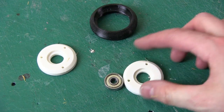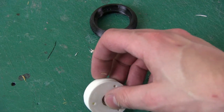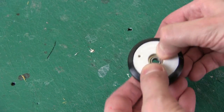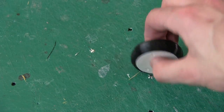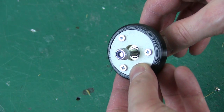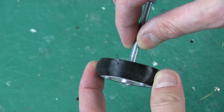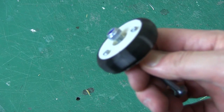Here are the parts. I've got my two ABS hub parts — this fits in here quite nicely and the two of them will press together and hold that bearing in. All we need to do is put on the Ninjaflex tire and bolt or screw it together with the holes, and that holds the bearing really tight. If I bolt a shaft to the inside of the bearing, that's going to run really well and hold it to stop it wobbling. I've stuck a 6mm bolt through there — the middle part of the bearing rotates, and there's space for a 6mm lock nut — so once bolted from both sides that'll hold that wheel really stiff on the shaft, giving me a nice sturdy wheel mountable on a single point.